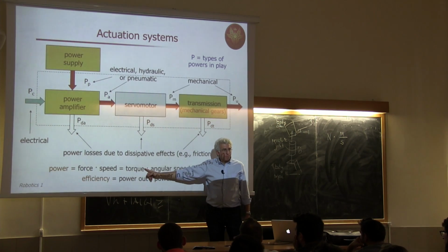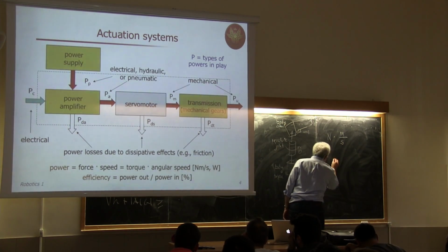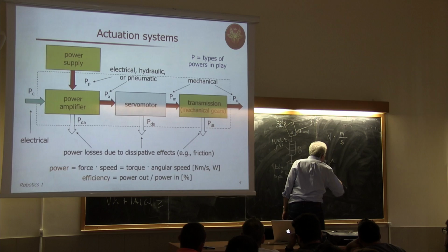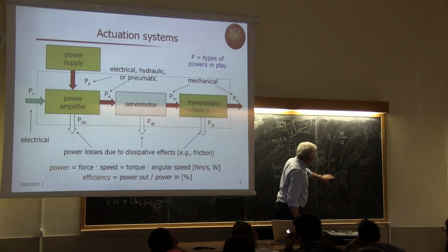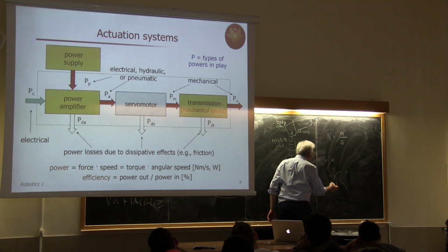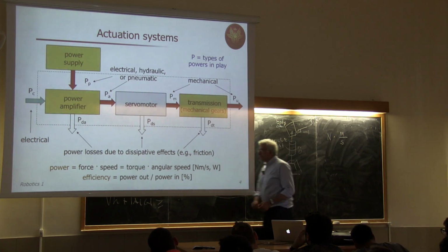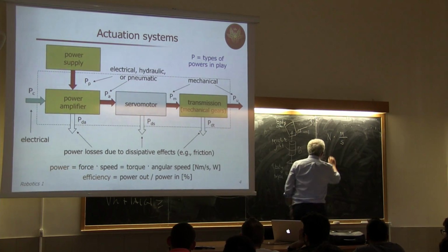Newton? No. Remember what is a torque. Torque is also equivalent to a momentum. So you have a force here, and if you compute the effect around the point of distance d, this force times this distance gives a momentum around this point. Since a torque can be seen as the product of a force times the distance, what is the unit of torque? Newton meter.